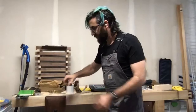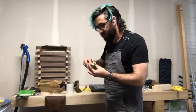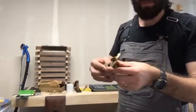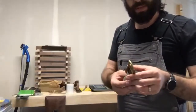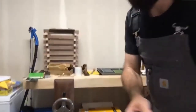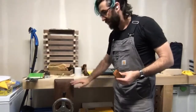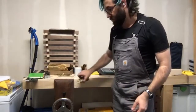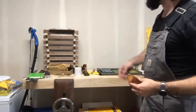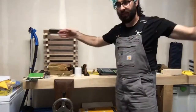It does pretty good. I also have this little block plane here, which I should put my iron back in before I lose it. And it is a low angle bevel up plane. It's really useful for removing material really fast. It's not precise. It doesn't have a big reference surface, but for this curved surface here, it came off of a bandsaw and had ridges all throughout it, and I had to smooth those out. So I used this to get that to a rough smoothness so that I could do better with the card scraper.